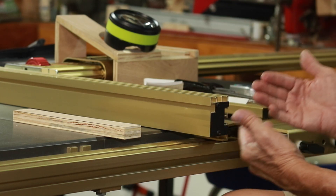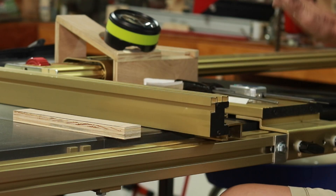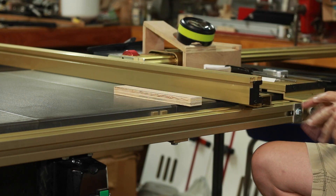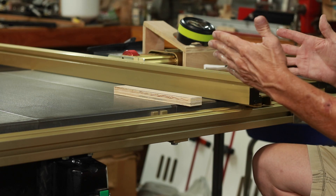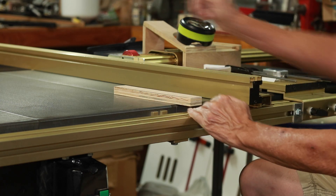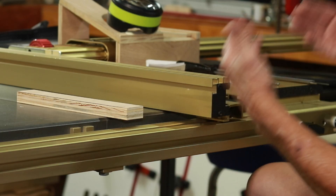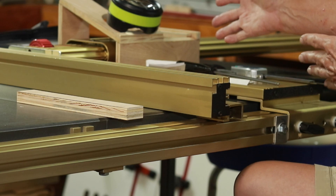With that, I turned my attention back to realigning everything, and unfortunately three times I had to do this from the positioner base itself. I took the LS positioner completely out, realigned the base, got it set at the proper distance, set this back in, lined everything back up — and it was screwed up. What I found out the second time: when I went to tighten the T-nuts down here, the rail on that side would flex out because I tightened this side first. I started scratching my head thinking, what the heck did I do? After thinking about it, for the third time now, I took the positioner out of the positioner base and started from scratch.